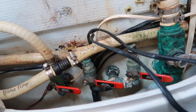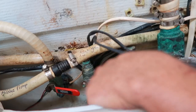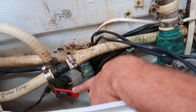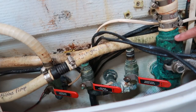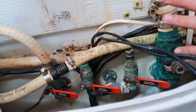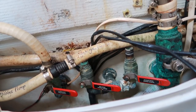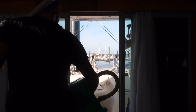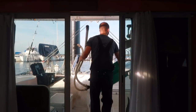That was about as good as it could be. On each head on our boat we have three through-holes and four seacocks. We have this one double seacock for the drains for the shower and the sink, this one is the inlet for the water, and this one is the discharge for the toilet. As you can see, they're kind of old and a little bit corroded. Replacing the seacocks is on our to-do list, but it's further down — we want to wait until after our refit so we know exactly if we're going to keep all our seacocks or glass some over. In the meantime, we treat them like they're dynamite and stay away from them.